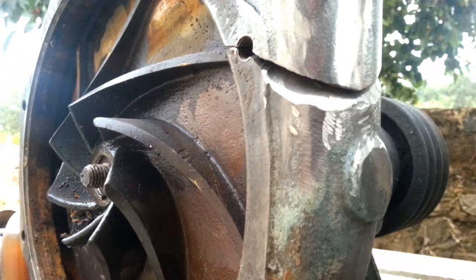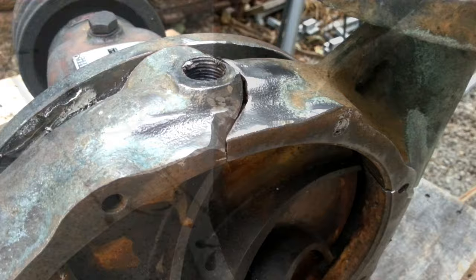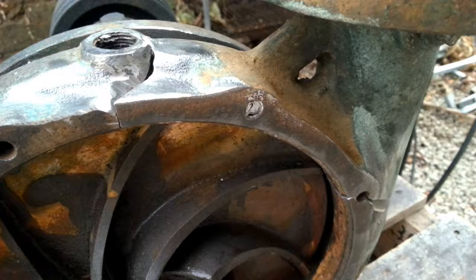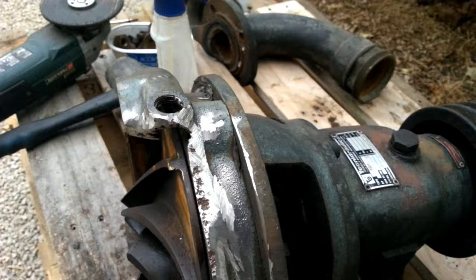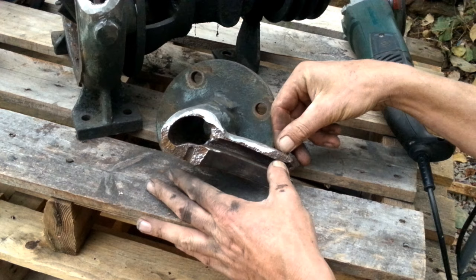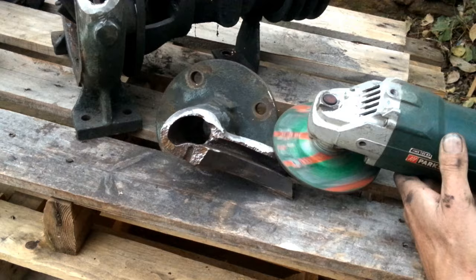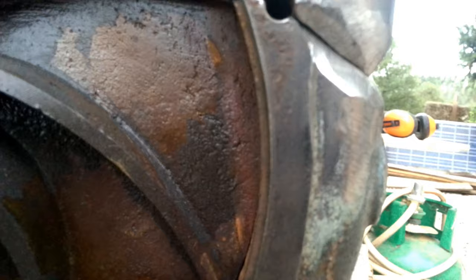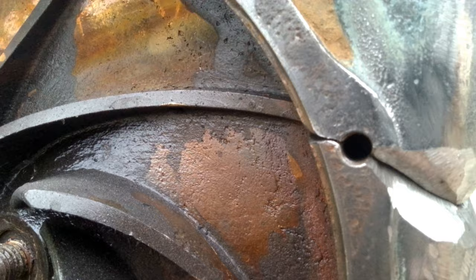Let's see where I'm V-ing out. I've only done the pump part, not the loose part. You can see I'm V-ing it out on this side, and I'm going to do the other side next. I've removed most of the rust from the inner edge, but I'm not going to go too far with it. There and there is the original thickness of the steel, and you can see where I'm taking this back. You can see how much I've V-ed that out. I'll be very careful around this bolt hole because I'm going to have to re-tap that.